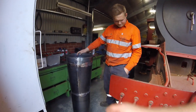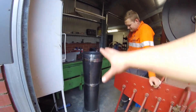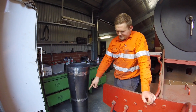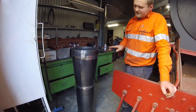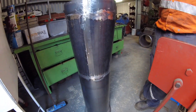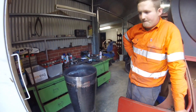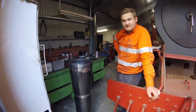Explain to me — this is a newer design from what was the original train. So what makes this different? Well, the idea behind that is you've got a diameter down there that is only slightly larger than the gases being expelled. So what that does is it doesn't allow any air to come back down the funnel, which will increase your draft on your fire. Because it's creating a venturi with the taper there? Yeah. Very cool.